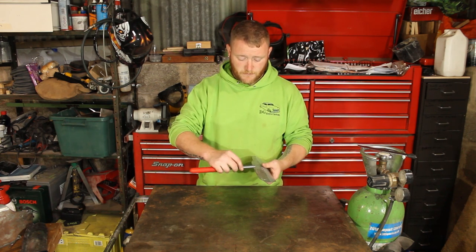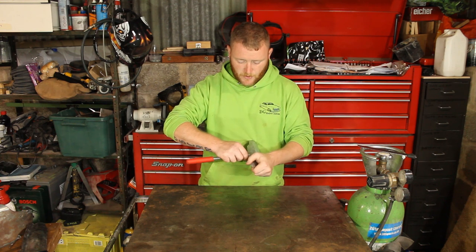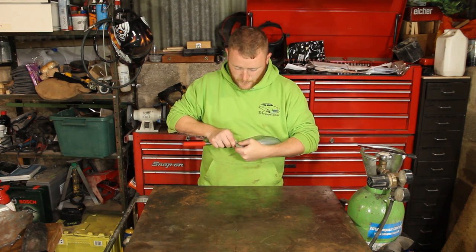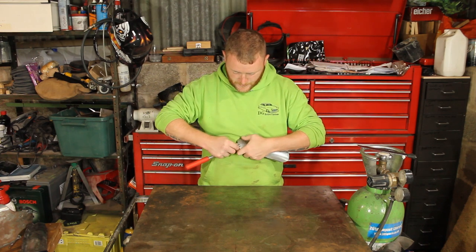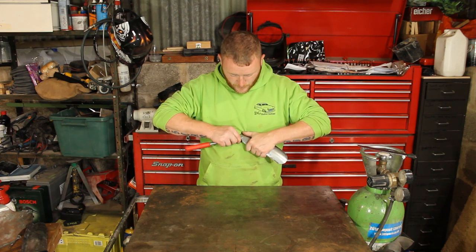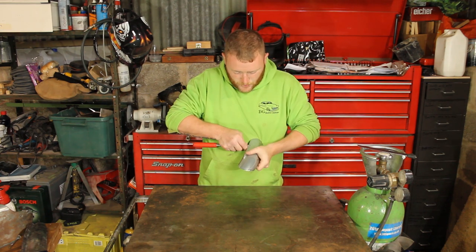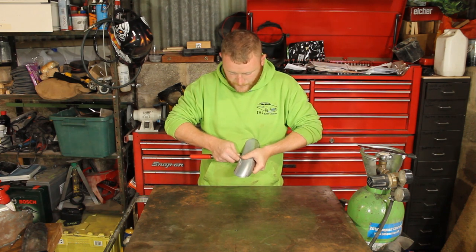What I'm going to do is show you how to do it. It's curved all around so it's a nice little shape, and it really is so simple. All you do is hook it over the edge and then you just tweak it. The key is to do it very, very slowly in very small little steps - that way it will slowly stretch and shrink itself around, constantly pushing in into the metal. As you see, I'm not moving it a lot. You just slowly go around.